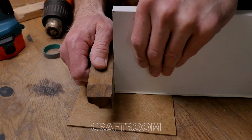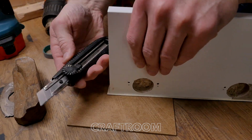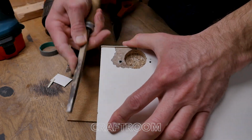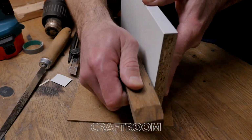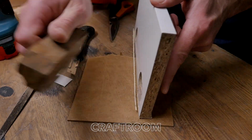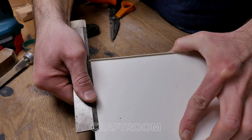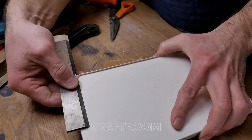When the edge has cooled down, we begin to trim it. It is convenient to do this with a veneer cutter or with a construction knife. Now the most difficult thing for beginners is to trim the edge along the length. A construction knife is not suitable here. This can be done with the same veneer saw. But the most convenient option for me to do this is the planer blade. Forward, down, we cut a corner. And then everything is like clockwork.